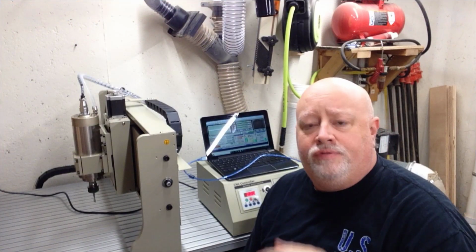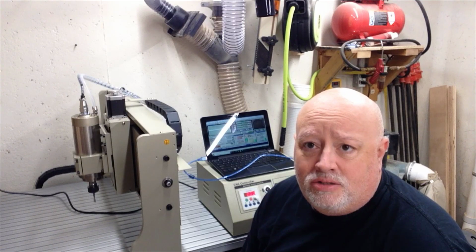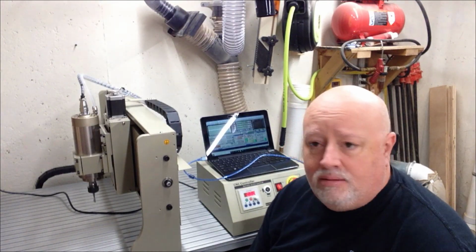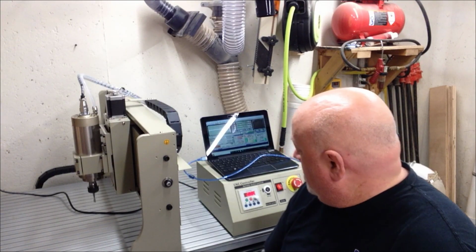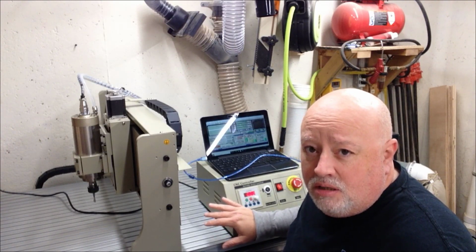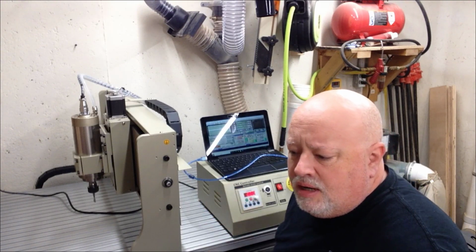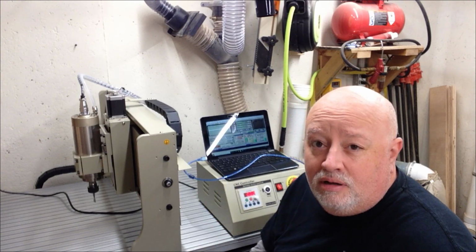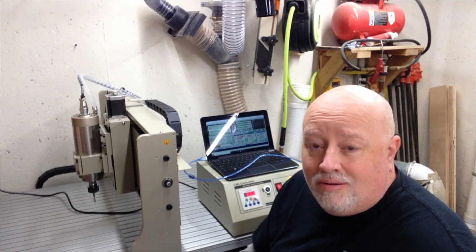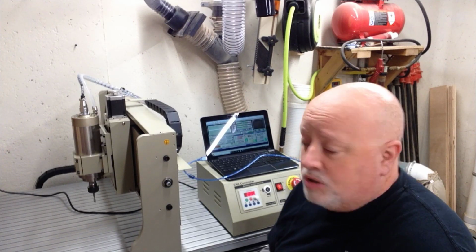Okay, so in the last video, the things that we went through were basically running all three axes through their paces. And what we came to the conclusion was is they were functioning properly. I did have to go and make a couple changes to the VFD to get it to work with the software. I think it was one of the troubleshooting settings that was set incorrectly, so I switched it from a 1 to a 0, and now it works properly.